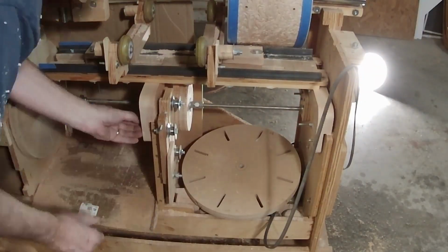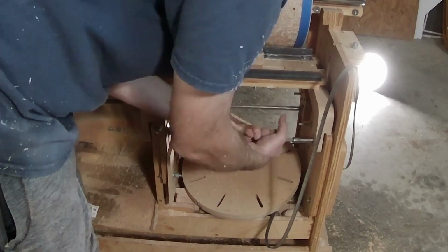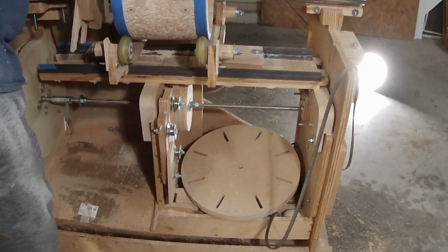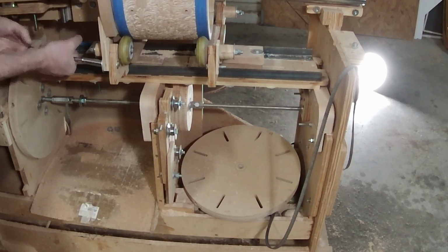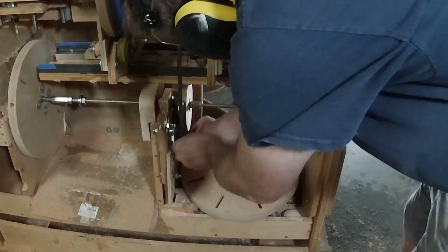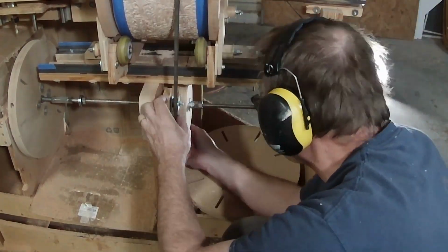There's a carriage that goes on the CNC. It holds the drum. There's wheels on it. There'll be a plate on each side of the drum so the drum can't shift left and right, and a belt that goes around the drum so the drum will spin and the router can cut the inside of the drum.